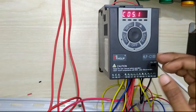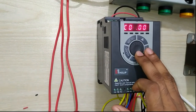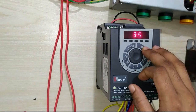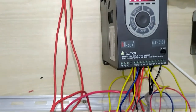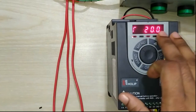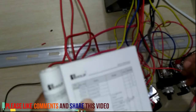Jog mode is now selected for that terminal. Next, I set the jog frequency — parameter 3.11. First press 3, then shift to navigate to element 1, and you will reach parameter 3.11 — the jog frequency setting. I set this to 20 Hz. Now I start the motor in jog mode forward. The motor rotates at 20 Hz as set — DI1 (C055-412, third switch) is running at the jog frequency of 20 Hz.